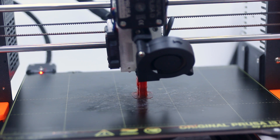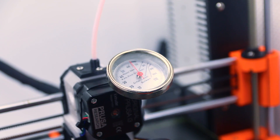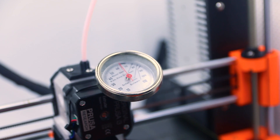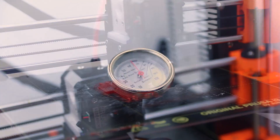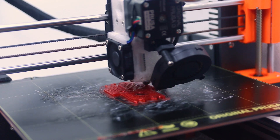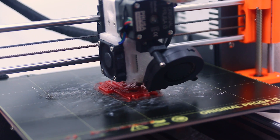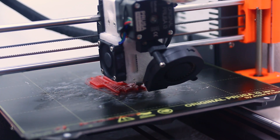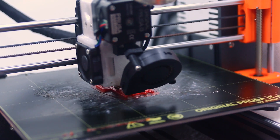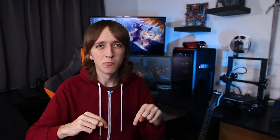For me, I'm basically going as high as I can possibly go with my enclosure without melting the printer itself, as the Prusa i3 is using PETG parts which I don't want to go above 60–70 degrees Celsius. But once I get all these parts replaced with polycarbonate parts and get the electronics out of the box, I'll go up to almost 100 degrees Celsius. While I do think you need an enclosure to print polycarbonate, it doesn't have to be a fancy one — even just a cardboard box will improve your chances dramatically. Building a simple wooden box and adding some insulation will not cost much at all and get you a lot better results.